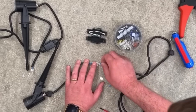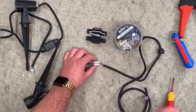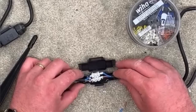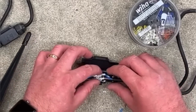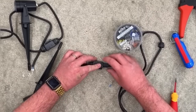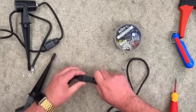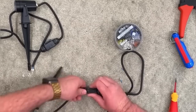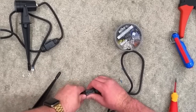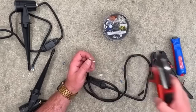You'll notice we haven't used a WAGO connector — that's because it doesn't come with one, so we're using the screw connector that came with the Barney and dropping that into the gel. We could try a 2-2-1 in there but it looks a little tight. The gel is actually doing the IP protection; the gland ends Rick's about to put on are just for strain relief. There's something satisfying about it — you get that ectoplasm squeezing out the side, a little sticky on your hands.